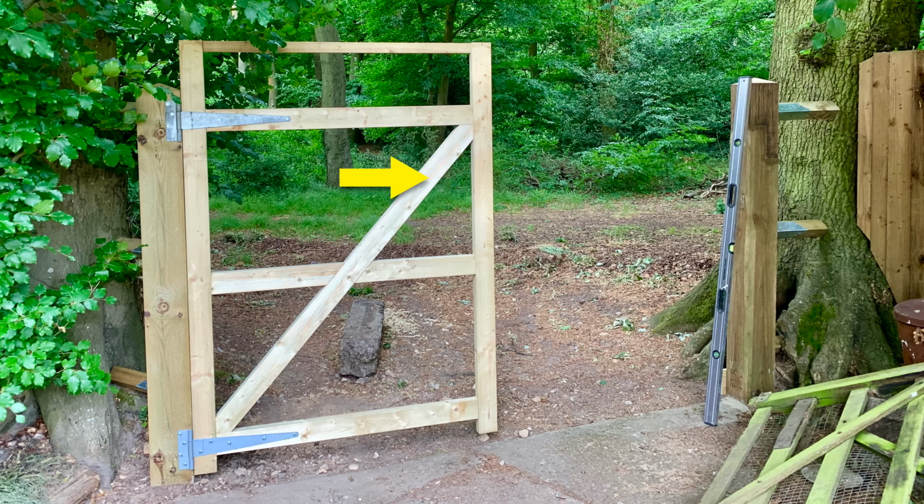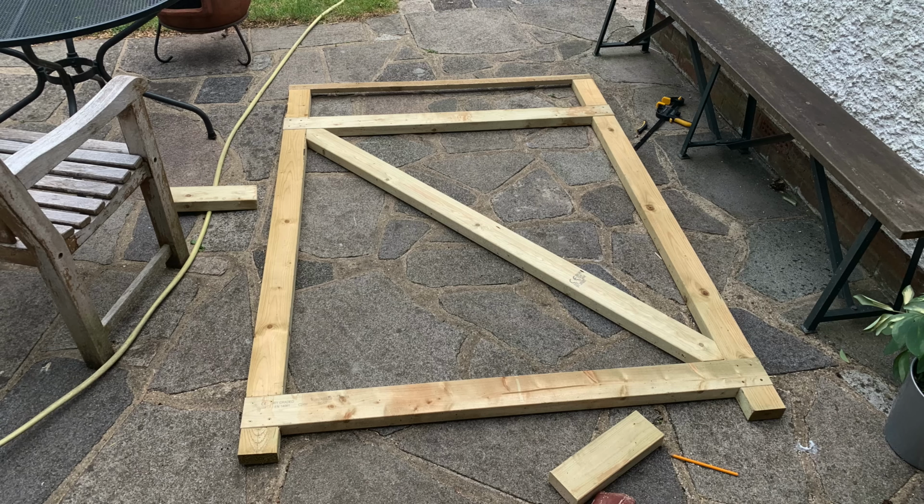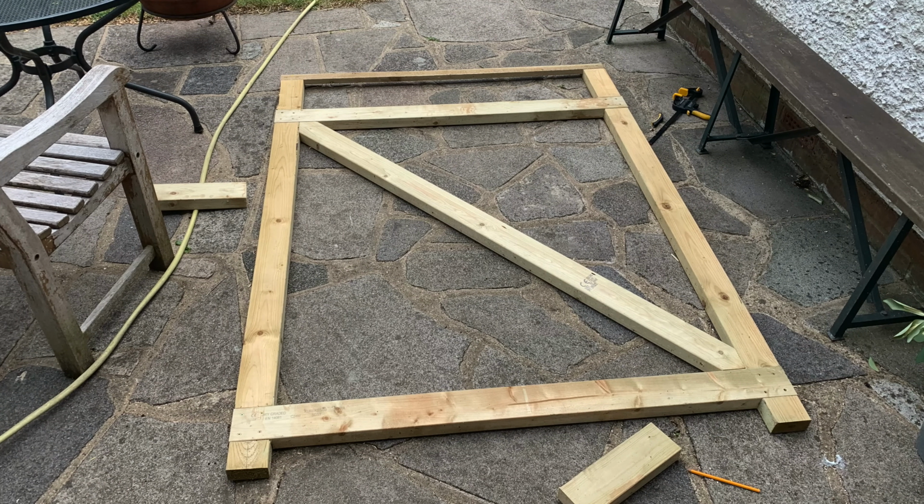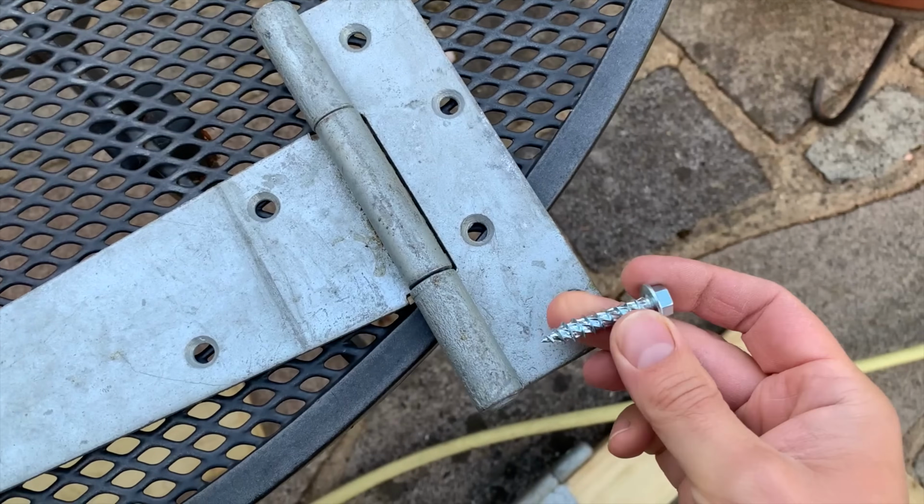So following the rules for bracing, this time mine runs from the top all the way down to the bottom, and the middle rail is not half lapped in as it's not structural. It's mainly there to steady the brace and to act as something to nail the pails to in the middle. I made the gates in the same way. The only difference was that I cut a rebate rather than a half lap for the counter rail at the top. The hinges were another garage find.